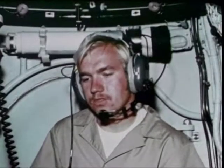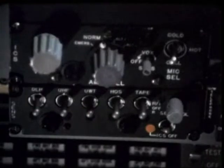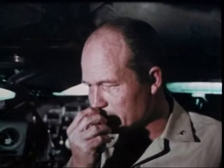The vehicle's intercom links the three spheres. Speech and other data are recorded. The DSRV also has a UHF radio for communications while on the surface, and underwater telephone for communicating while submerged. It communicates with the mother sub at regular intervals, relaying additional data. All significant sonar contacts are reported immediately.